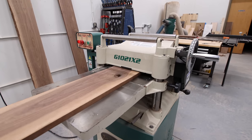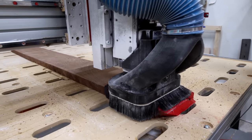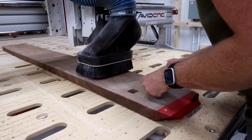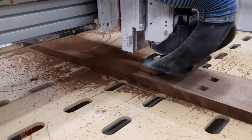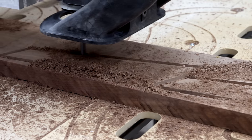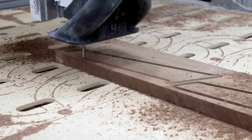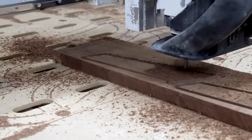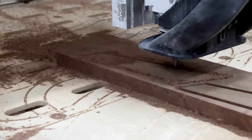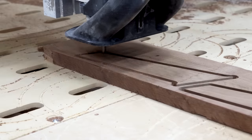Given the high cost of materials and limited supply on hand, it was imperative that I be careful and not mess anything up. So immediately, I was careless and totally messed it up. When I was creating the tool path, I made an error and set up those tool passes for a quarter-inch bit, but I was actually using a half-inch bit to cut everything. Thankfully, I was monitoring the carves and quickly caught this, so I was able to switch to carving those angled leg pieces on what was left over from the board I messed up. The remainder of the carves went pretty smooth.